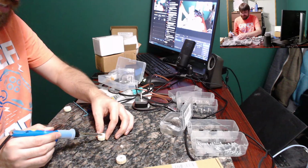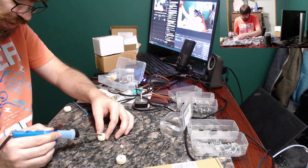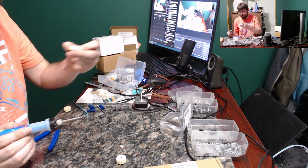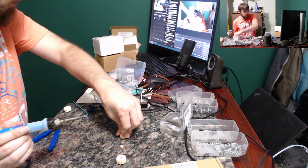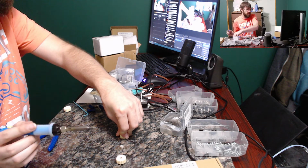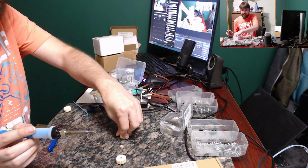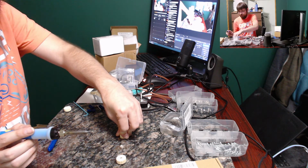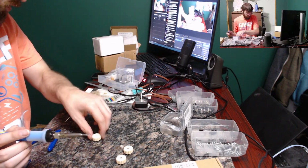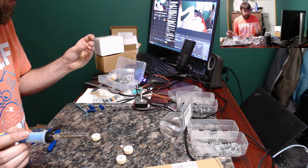In all fairness, I never had any issues with bed drop. It's only when you're first setting your printer up, when you're changing Klipper configs and stuff like that, where you power off the printer and the bed falls. Once your printer is up and running and you're printing on it, your bed's basically never going to fall. So that's usually why I didn't bother with it on Simple Core or the Rooks, because it's not a big deal. But I can see why people like the geared Z.